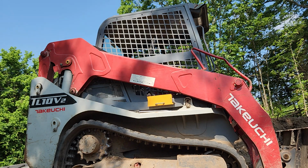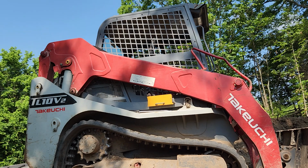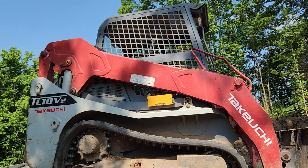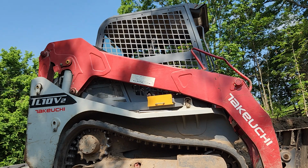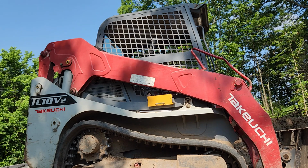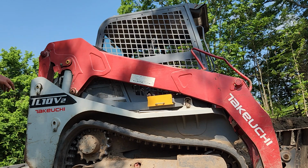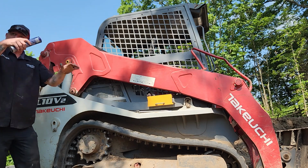But I mean, like the rest of it as well. Same thing, because this is not a bearing, okay? If you was looking at your car and doing that for your bearings, yes, I would say high temperature grease for wheel bearing and chassis, because that's going to be running down the road at 50 miles an hour. This runs slower than a turtle. And all you're doing is up and down, pretty much just squeezing these pins, wherever pins move like this, okay?